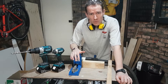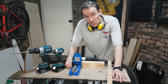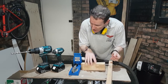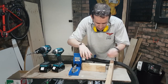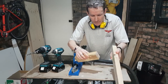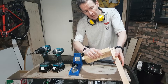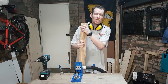I've got the Kreg K4 jig set up but I'm using an unusual combination - a 35mm board and a 45mm board butted together. The jig measures up to 38mm, but you can go bigger according to screw length using the bigger screws from the Kreg starter kit. I'm doing a test run to find the right setting, set to 38mm depth for both the bit and drill depth. These are my stiles and rails - I've drilled my test pocket holes with a 64mm screw, and joining them together that screw is the perfect length at the perfect depth, giving the strongest possible joint without blowing through the other end.